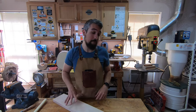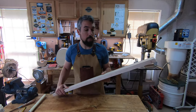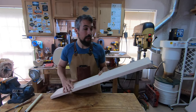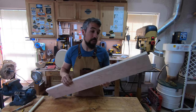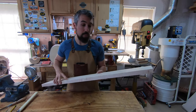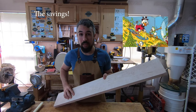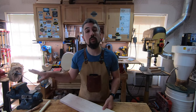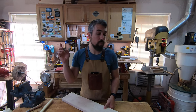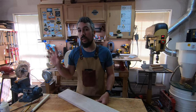The other thing is you're kind of stuck with their dimensions. It was probably like two years ago with my drum sander that I was like, man, I should make my own binding. I found out that I can get on eBay or on some websites like curlmaple.com and buy a piece of wood like this for 40 dollars. I've already made probably 40 pieces of binding out of this and I'll probably get at least a hundred more. If you have a drum sander, this is the process you would use. So we're going to run over to the bandsaw, slice this up, and I'll show you my thought process as we go.